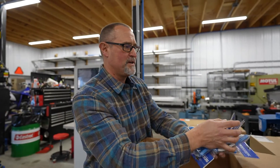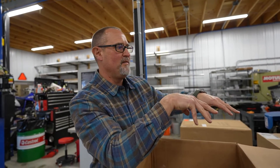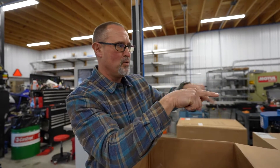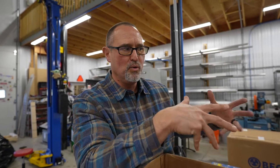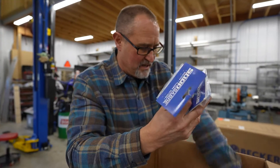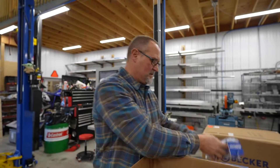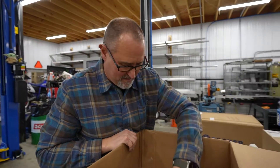Clamp-down kit — when we ordered the machine it's got a vacuum top but also has T-slots. We will be doing both. We do a lot of our own fixtures, so the fixtures will reference off location ports on the table and then we'll clamp it all down. Having the T-slots means we can clamp down our own tooling on top. Lots and lots of clamps — it's a pretty big 4x8 machine.